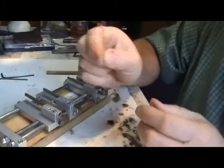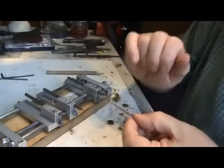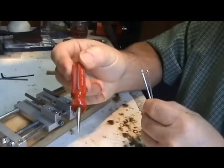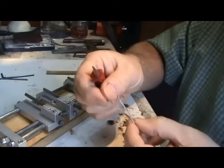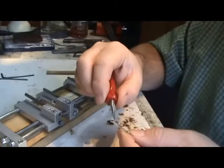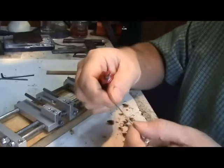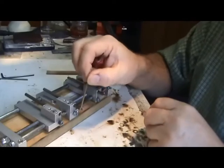Now that I've got these all ready and filed up, I open the holes out using a reamer — this is a high-speed steel micro-drill reamer from Squires. It is tapered, but when you're using very thin metal the taper really has no significance. Gently ream this out — don't push too hard or you're likely to separate the laminations. Let the tool do the cutting — open it out so that the holes fit over the stub axles on the jig, like so.